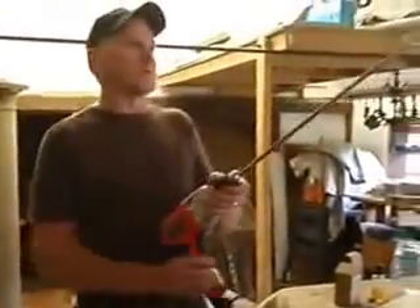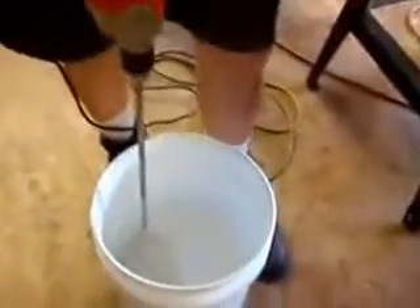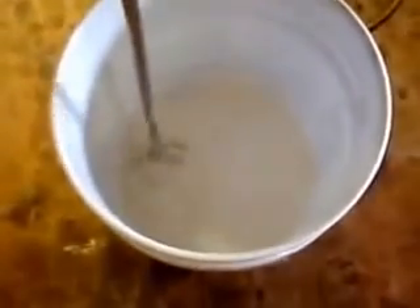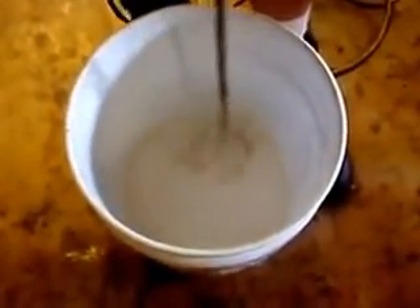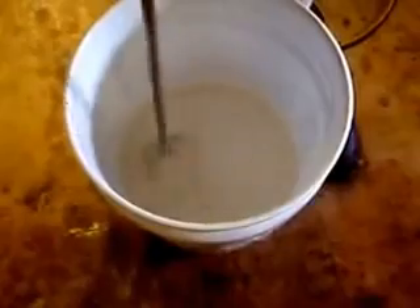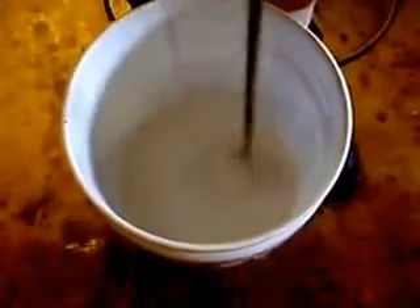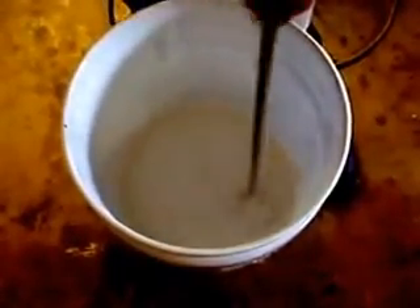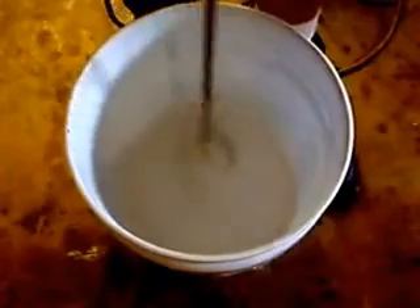The best tool I've found for mixing paint in the bucket is one of these paint stirrers on a drill — that's the best way to mix this quantity of paint. You kind of have to start slow on top and gradually mix it in. The powder will just start incorporating into the water. You might spend five to ten minutes just mixing — dispersing the powder into the water.